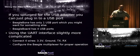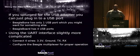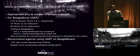How do you wire them to the Beagles? The USB stuff is easy. You just plug it in. The UART's slightly more complicated, but there's only 4 wires to connect: ground, power, transmit, receive. The other thing that you need to do is make sure you set up the multiplexer on the BeagleBone to properly use those pins.